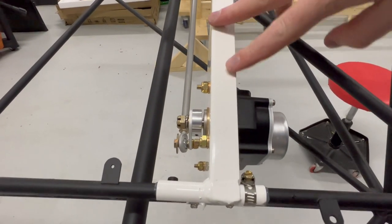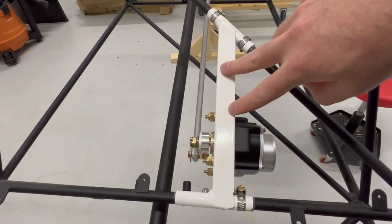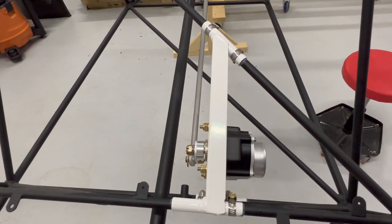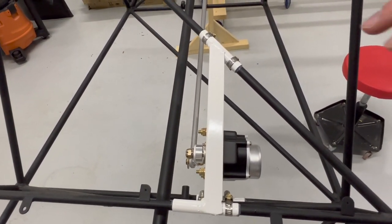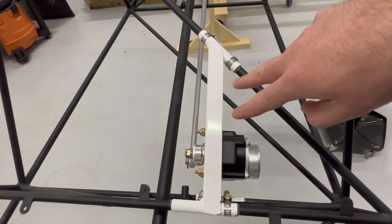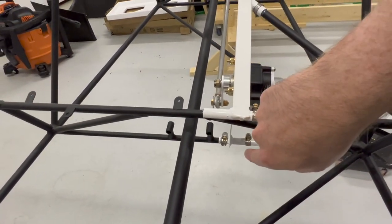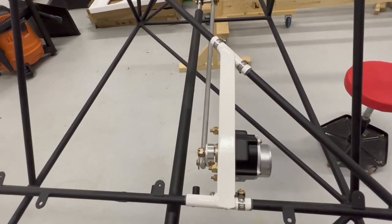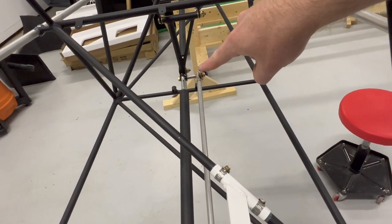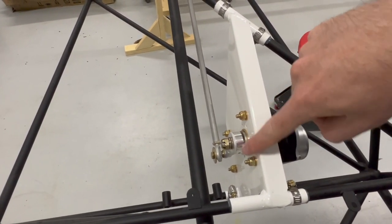At the pitch servo position, it was a little bit trickier to mount. This plate was a little bit warped coming from the factory. I checked with Heather and she said a little bit of encouragement to get it in would be fine, so I spent some time in the vise straightening it out. Once the servo was mounted to it and a little bit of teasing had happened, it sat in nicely and got bonded on these three positions here. These ties are holding it down as well. Just like the roll servo, I've connected up the rod arms all the way to the bell crank for the pitch push rod, but nothing is rigged as of yet, so the cage isn't on here either.